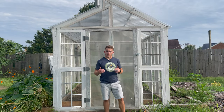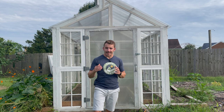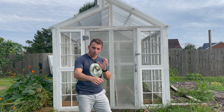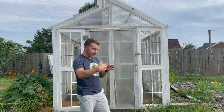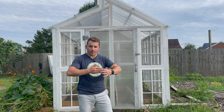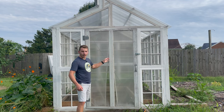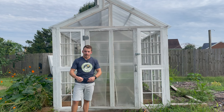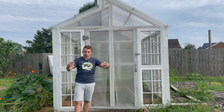For the front of the greenhouse, we used smaller windows to leave a large enough opening for a door, then simply framed it out with two by fours. I had to use my table saw to cut channels into the two by four that were the thickness of the polycarbonate panel, so I could slip the panel into the frame and hold it nice and tight. I assembled the sides and bottom first, cut a groove into the middle piece, slid the panel in from the top, then put on the top two by four like a cap and screwed it all together.